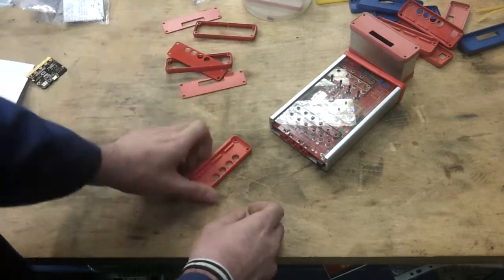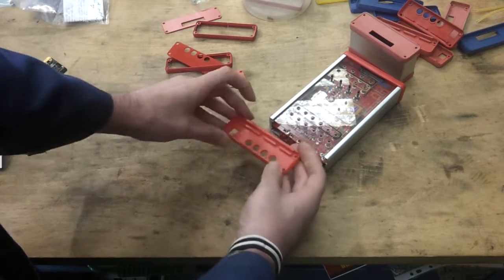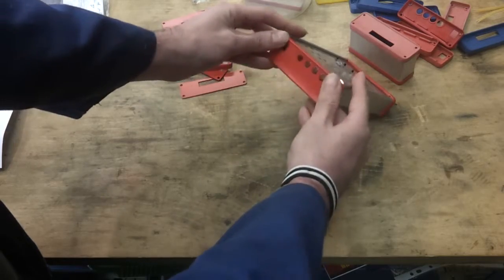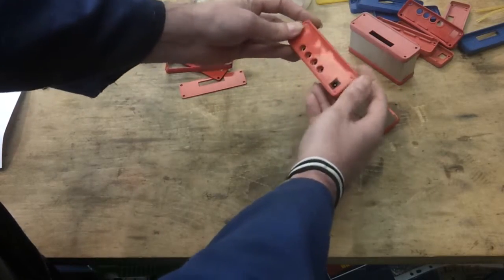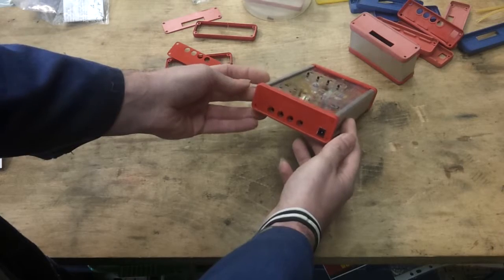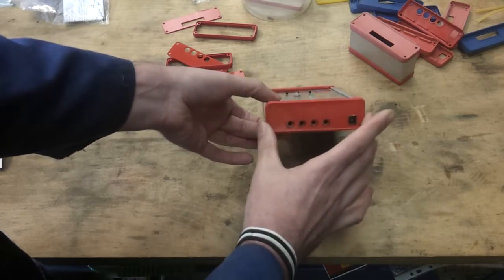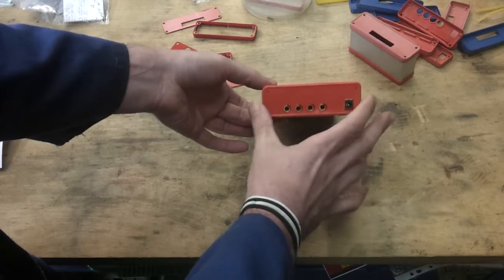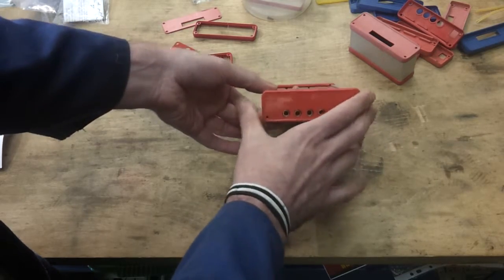So as a result of that I got asked: can I make some fully molded end caps? Not quite as simple and easy as it might be because the plastic shrinks and obviously I've got to cut the mold slightly larger than necessary so that it fits on nice and tight.